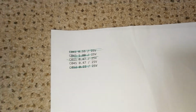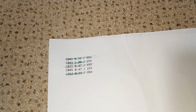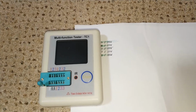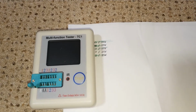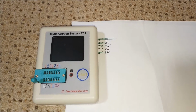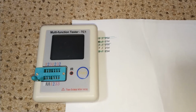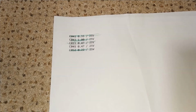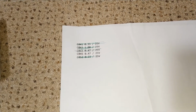But yeah, it's basically changed these 5 capacitors for the TANTs, and yeah, what a difference. I checked every single one on the little tester, and every single one was really high ESR, and many weren't reading anywhere near what they should have. I say many, I mean there's only 5, but I think only one was reading correctly. So definitely needed doing. But yeah, those 5, changed those, and all's good.